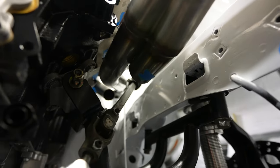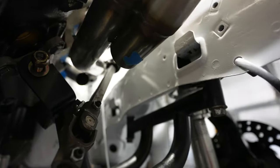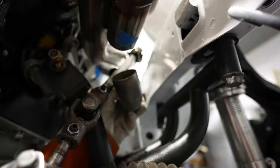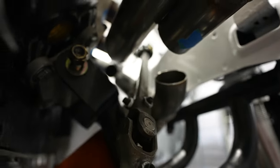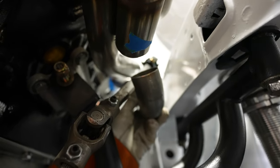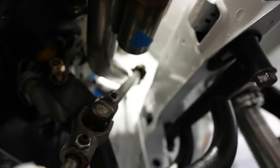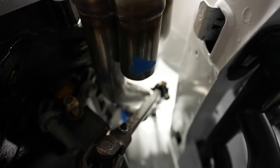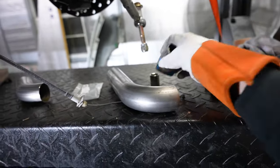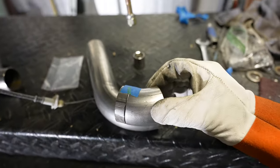I might completely change it up again. I have this piece that I cut for up top — you guys can kind of see that it starts to turn away from the steering column. Originally what I was thinking is come down off of that to here and just make that transition. All I've got to do is make that turn — it goes right around the column. I'm not fighting with it up top and it stays clean into the bottom. Thinking that might be the jam instead of messing with trying to be super tight to the knuckle up there. And then I don't have to modify the back; it'll be easy to land back in it. Now that I have some pieces cut, this is a 45 with a little straight added on. I think I can take the other part of this 90 and cut it — I'll get a little bit tighter out of it, and that might get me right where I need to be.